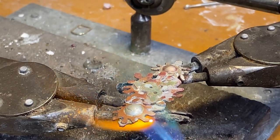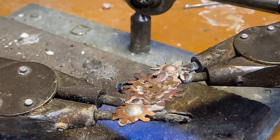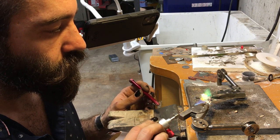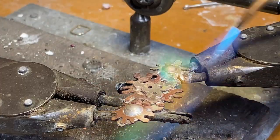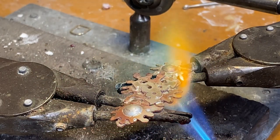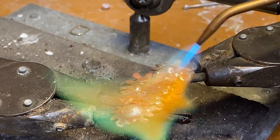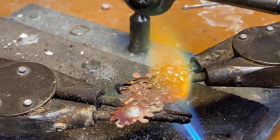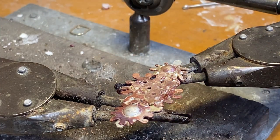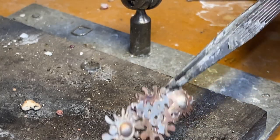That white powder you see, that's the boric acid. It gives you a telltale that the metal is hot enough to flow when it turns glassy. I use a superfine boric acid. You get used to holding metal at a certain color - that orange it gets when it's flowing that solder. Metal goes from normal color to red, then orange and yellow, and then it goes to white when you get to that really hot temperature. And when you're soldering, you never want to get past orange - it starts sagging at really high temperature and it just melts. Your project's gone.